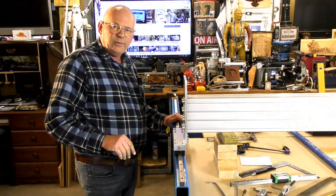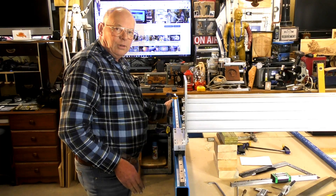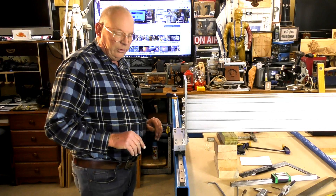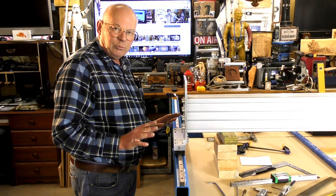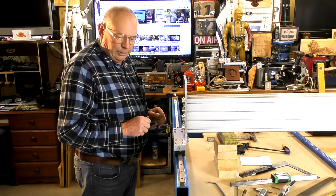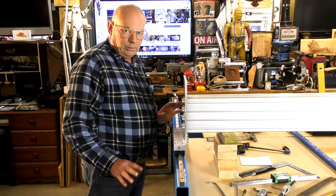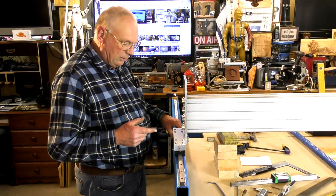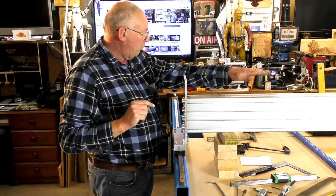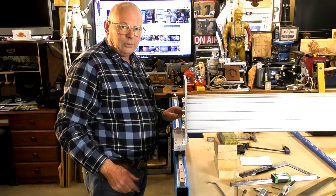I've got 15.29 — so I've got it down to 0.2 of a millimetre. The surface of this RHS is not perfect. I could mess around trying to move this back and forth all afternoon, so I'm calling it there. 0.2 of a millimetre is not much at all — sort of out of parallel with this edge. I'm going to say that's good enough. Because what's more critical is having this rail absolutely parallel with the rail over the top. The 0.2 over five feet is not going to make any difference at all.